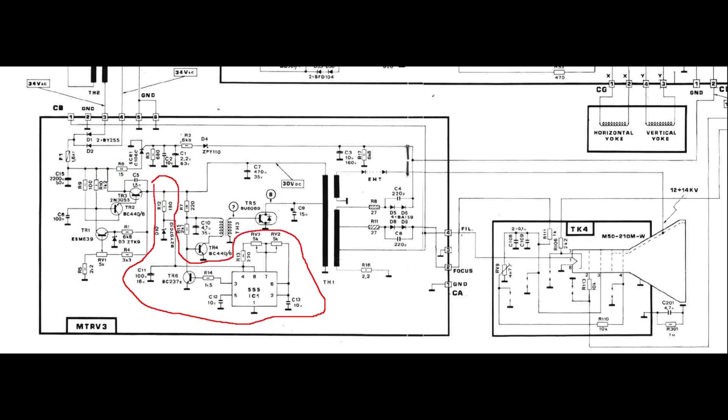A simple 555 square wave oscillator is used as exciter for the flyback transformer circuit. This oscillator has two trimmers, RV2 and RV3, to set its frequency and duty cycle. However, these two controls will interact. Notice that the 12 volt supply for the 555 is obtained with a big 5 watts resistor, R12, and a simple Zener stabilizer. The square wave then drives a 2-stages transformer-coupled transistor pair that switches to ground one tap of the primary winding of the flyback transformer, like if it was a normal raster CRT flyback circuit, except that we don't have the horizontal deflection coil in this circuit.